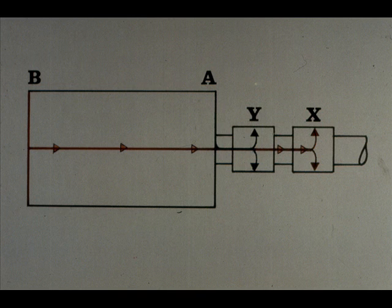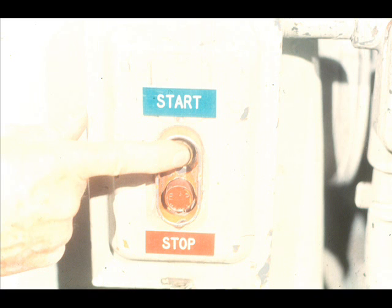There are also other unusual situations you'll encounter in two-plane balancing, in addition to what we've shown you here. Since it's impossible to cover all of the possibilities, we've selected the two examples which will illustrate the majority of the unbalance situations you'll come in contact with. The next step in our two-plane balancing problem is to start the driver and bring the rotor up to operating speed.